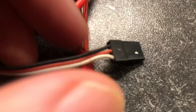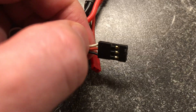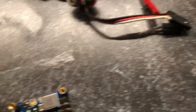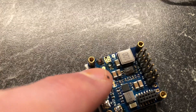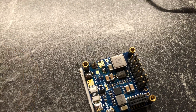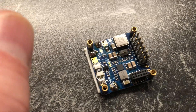Then you will have to open up this connector and take off the red one — the power lead — and the black one as well. You only need the white one, which is signal. The signal will be the only connection to the flight computer, on this S1 pin. You see these two — these two are the corresponding plus and minus for the ESC.